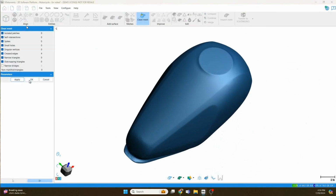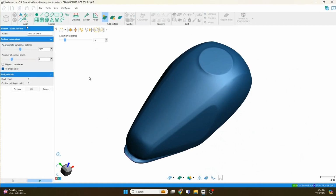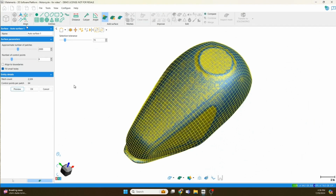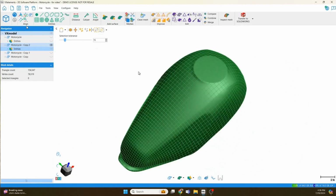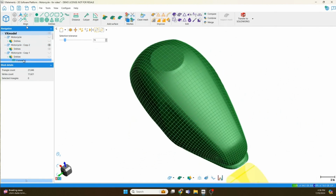So there are some different features. We've got single fit features. There's a clean mesh tool, a one-click check over to make sure the mesh is good. But when it comes to surfacing, you can do a bunch of things. You can cut cross sections and send them over and make a parametric surface on the other end, let's say in your CAD program, or you can fit a very clean, nice NURBS surface here. And it just depends on what your end result is, like how you can model, the capabilities of your manufacturing, a few different reasons why you do one or the other. But yeah, we've got a very nice tool that does a clean surface on anything you need. And then you can transfer that right to SolidWorks. In this case, we can go to Fusion, we can go to Creo, Inventor, and depending on other applications that you use as far as reverse engineering, we can expand upon that.